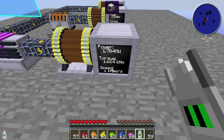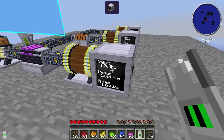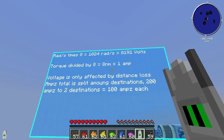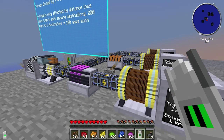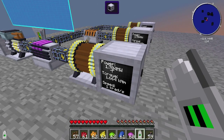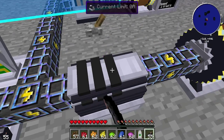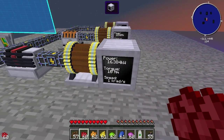Let's say we want to produce 16 Newton meters of torque. We know that torque divided by 8 equals amps, so 16 ÷ 8 = 2. We want a limit of 2 amps. Set all bars back to zero, then place red (2) in the ones column — 2 amps — and we get 16 Newton meters of torque output.